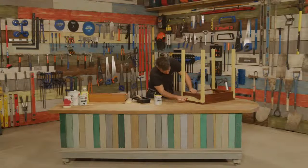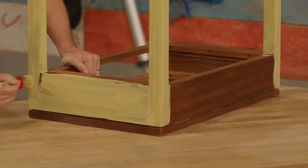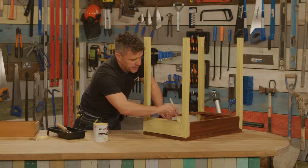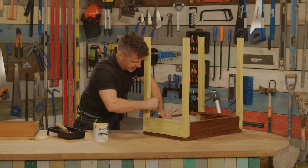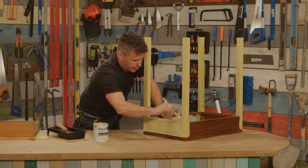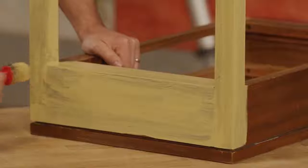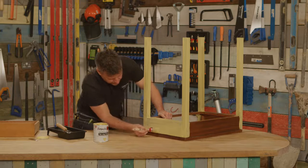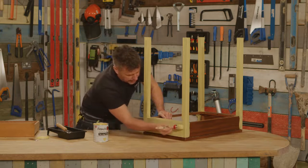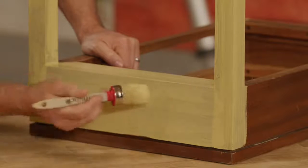Applying a small amount of paint along the edge, I'm also going to paint the underside of this edge here — which is always advisable. You won't quite see it but it will give you a better edge going around the corner. I'm just feathering it across going with the grain of the wood, but as you can see I'm lapping over onto the legs I did a moment ago.